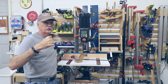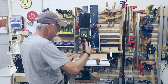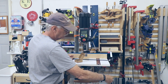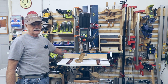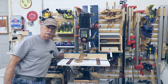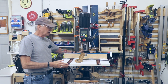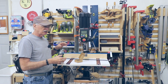I'll link in the description when I do this video of where I got this idea from — several people have done this. I'm going to move the up-and-down lift crank for the drill press to here, so you can just crank it up and down here. I'm going to move the locking handle out here so you can just grab over here, you don't have to reach around, and you can lock it here. The reason this table has to go back further than the post itself is because that's where I have to mount some of the holding parts for the shafts and gears.